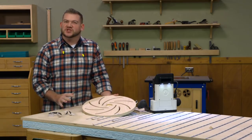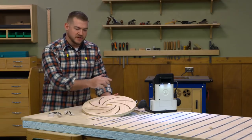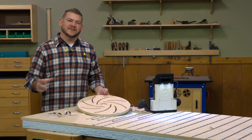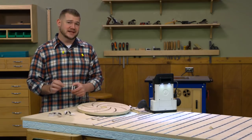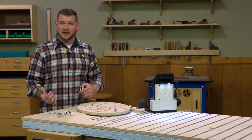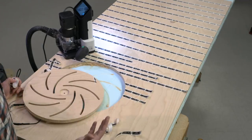That's pretty much CNC quality cuts from a handheld router with a little help from a computer. There are a couple types of cuts I made: an outside cut around the outside of the artwork to cut the shape free, inside cuts for the slots that jaws will slide in, and a pocketing cut for the headstock. Now that I've taken a part out of this sheet of plywood, I can save this plywood with the tape already applied. A roll of tape costs about $18 and covers about a sheet and a half of plywood. Once you've scanned the work surface and cut out of it, that work surface is saved in the Shaper — you can pull this sheet off the rack and the work surface is already there. Plus, Origin knows where you've removed stock from, so you can butt parts right up close to what you've already cut out and have very little waste.